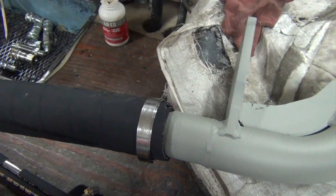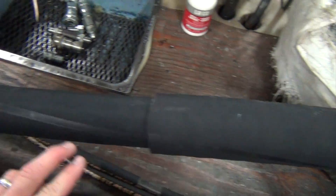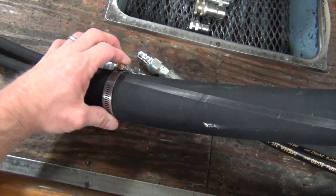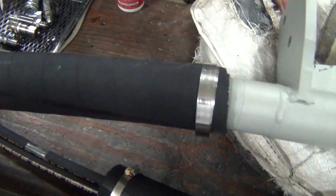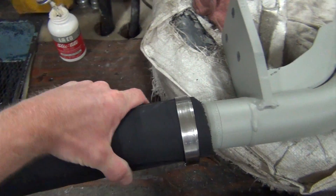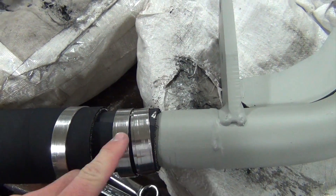Your vibrator will look like this as it's on the paver. You have your protector hose and then the inner cover hose. What you'll want to do is loosen the worm clamp back here so it has the ability to slide, and then on the protector hose you want to cut the clamp and slide it back — that will expose the two bands and you'll just want to cut those.